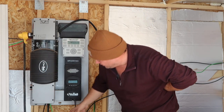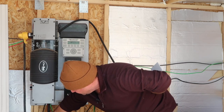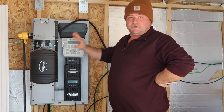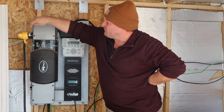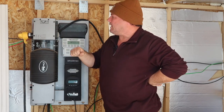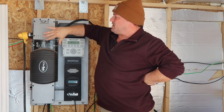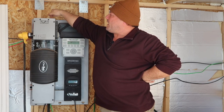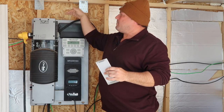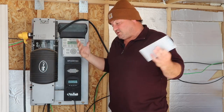This is actually the inverter. All the electric comes in and you can see my batteries — these thick double-aught cables here are my battery positives and negatives. You can see my ground in here, and then you can see this photovoltaic wire coming from the panels — the positive and negative come in at different places so the entire system can communicate and pulls all the photovoltaic in. It converts it over here. I've got a 110 plug that runs my trailer — I can get about 20 amps out of that. The power is all protected up in here. I can take my positive and negative bars and run them out to a completely new circuit box for a different building, and it converts, inverts from DC to AC in here, and then I can push it and use it in multiple places.